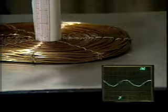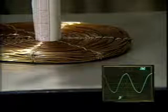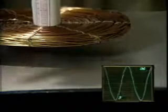This plate has a thickness of 6.35 millimeters, which is about half the skin depth. Remember that with 1.27 centimeter thickness, liftoff occurred at 15.5 amperes. With this half-skin-depth thick ground plane, liftoff occurs at 16.3 rather than 15.5 amperes RMS. This current is only slightly higher than with the thicker ground plane, so even though the ground plane thickness is now about half the skin depth, it still acts essentially as a perfect conductor.